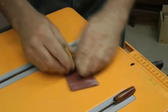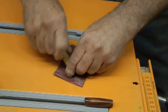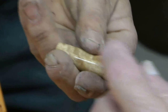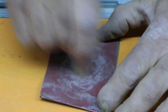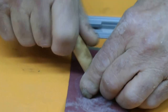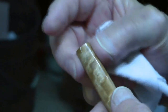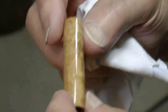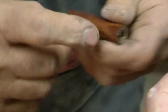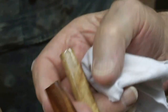Now I do get some 1200 grit and just do little figure eights — just to clean any excess. Then I just take a very light trim to put a tiny little chamfer on that end, so there's no sharp edge coming across the end. You can feel how rough that end is still — very little figure eight, and I'll turn this around so you get every edge on it by doing a little figure eight. And there's the one blank — done. It is a super hard finish. That's just beautiful. This one is a bit of Blackbutt from the Riverina in New South Wales. Magic.